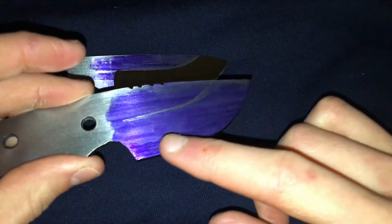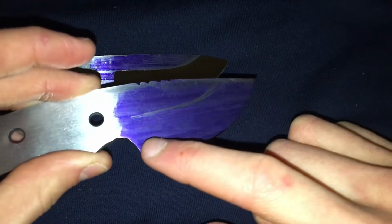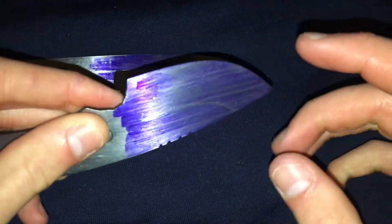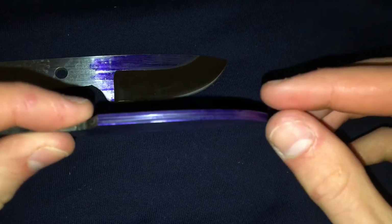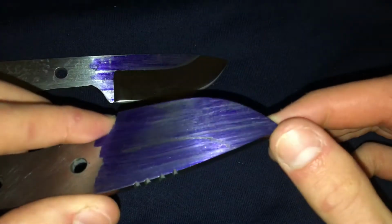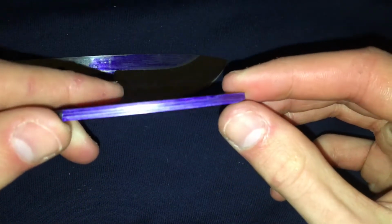So yeah, got to grind the bevels here. You can see I've got my marks out. I've got the Dykem layout fluid on here. I've got my line scribed with the calipers, and I've scribed my two center lines as well that I'll grind down to. I'm going to break my 45 degree angles. I'll break my 90s on here.